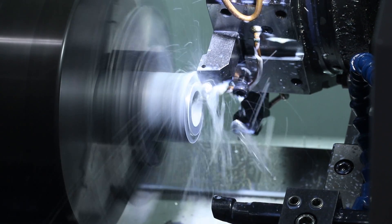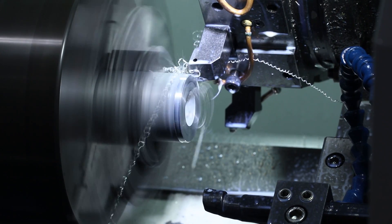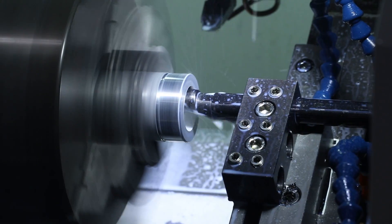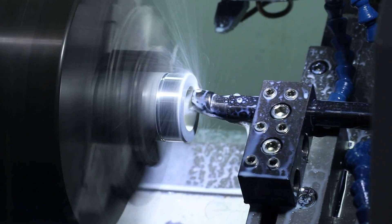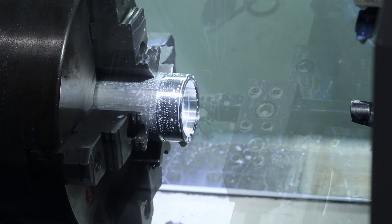Birds still need homes, and we're happy to make these indestructible metal nests for them to live in. But seriously, we're still looking at other ways to improve this, but feeding harder on the slant has helped a lot to eliminate that problem for us. The next thing we'll be trying is inserts with a smaller nose radius, so it takes less of a cut to activate the chip breaker.